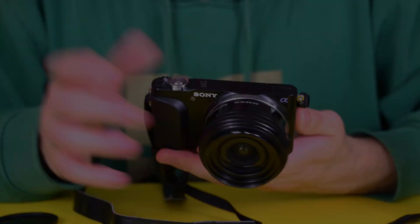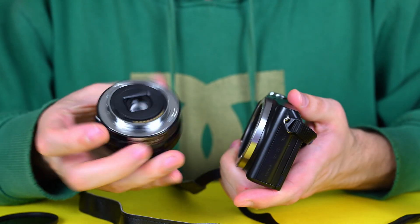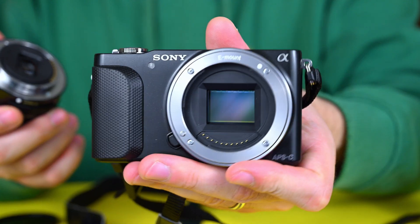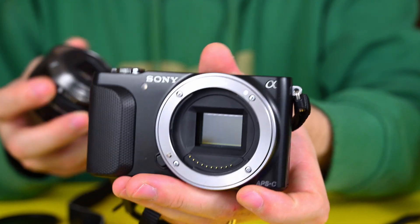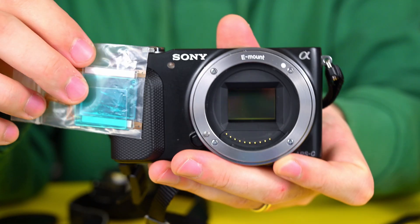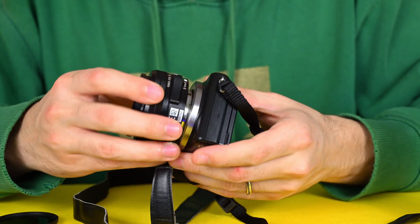Let's take a closer look at this camera and see better how it works. Here we are — this is my cheap infrared camera. As I told you, I paid something like 70 euros, and for the lens you can find any lens you want. I removed the infrared cut filter from the front of the sensor by hand — in reality it's really easy to do, you can see tutorials. Here is the filter, the IR cut filter. As you can see, it's blue; the sensor is gray now. This sensor can see every type of light, and this is amazing.